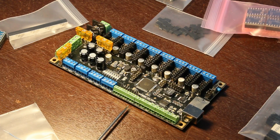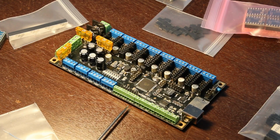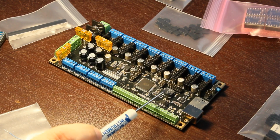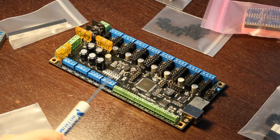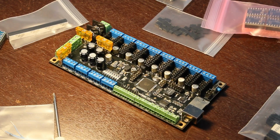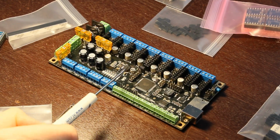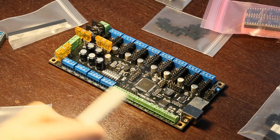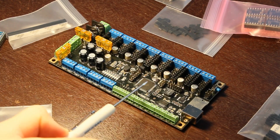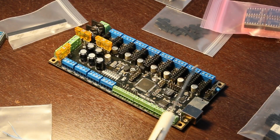So back to the schematic, the USB port, the micro SD card. It's got a little beeper on it. Here's a little beeper, this little surface mount buzzer. It's kind of cool. Of course, the main brain chip right there. It's a 2560. I was quite surprised actually. I hadn't really seen a pin out of this, but you do still have, even with all this stuff broken out, expansion 1, expansion 2, expansion 3, expansion 4, and 5 somewhere around here I saw.